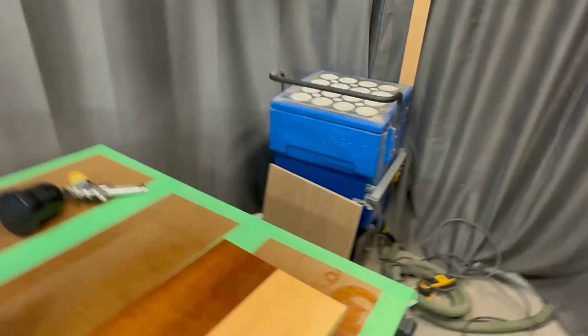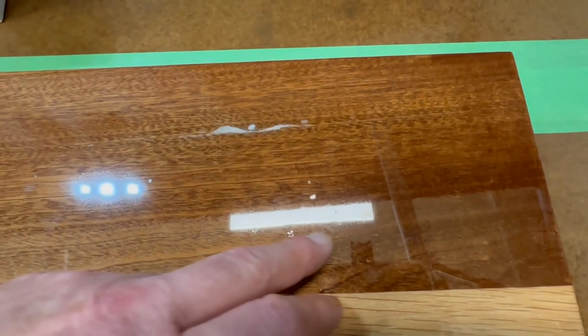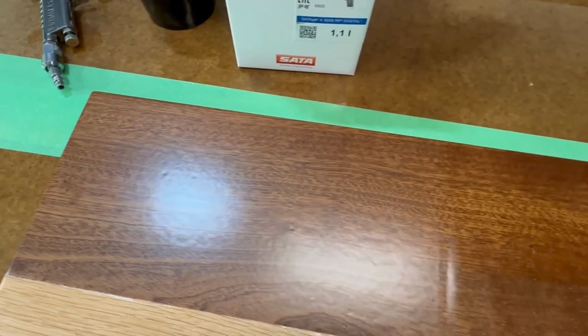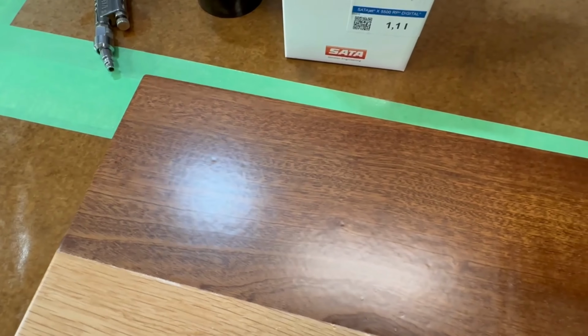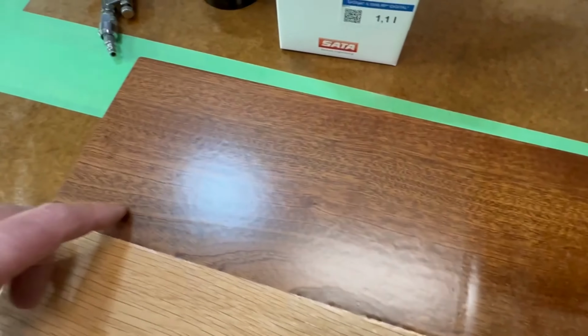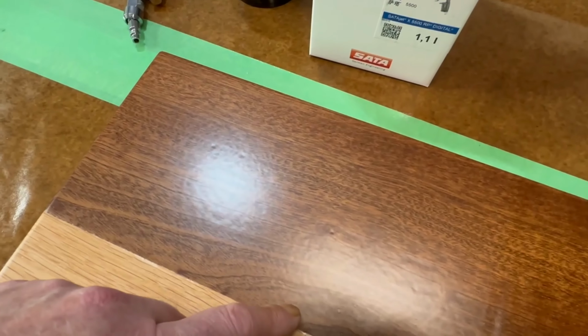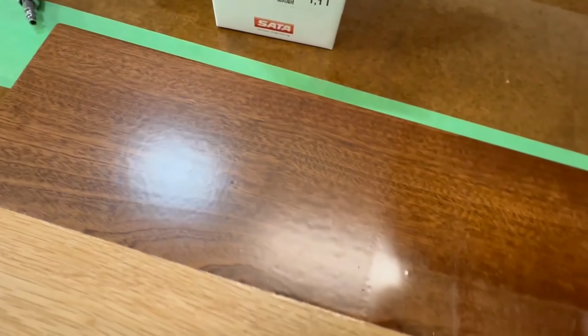And especially when dealing with the Wood 700 clear coat in gloss, I got here and there a number of air bubble enclosures in the finish. And here on the left side, for example, this is finished also in the Wood 700, but in satin finish. And the satin, and especially the matte, they are ever so forgiving, and you can really only see such little tiny imperfections when you know about it and you really look for it. So here is one, for example.